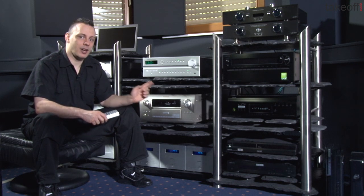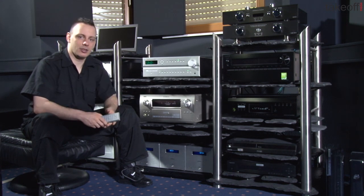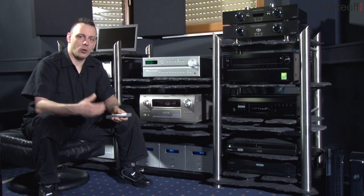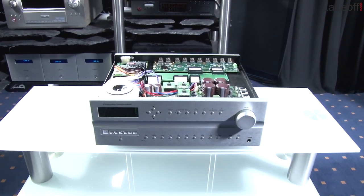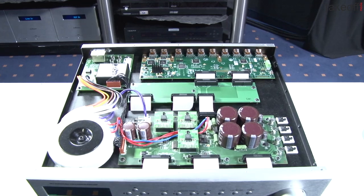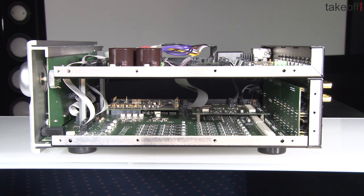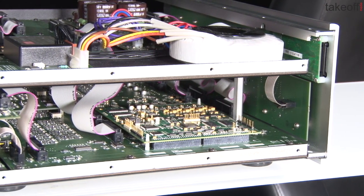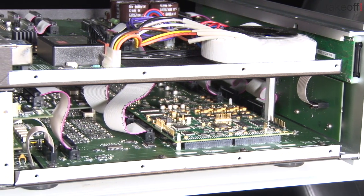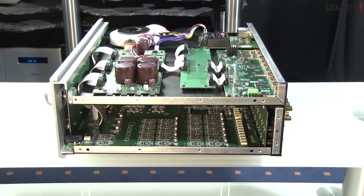But the SP3 is built modularly to be able to keep up with the techniques and future generations. With this way of construction, the user is able to change several parts. The consistent layout of this device you can see after a look at the inner life. Here we can see that it has two floors. On the upper floor, we can find the whole power supply together with the HDMI section. On the floor beneath, we can find the analog and digital audio processing. Generally, Bryston put very much attention on short and optimized signal paths, which is recognizable very well in the signal-to-noise ratio of 105 dB.